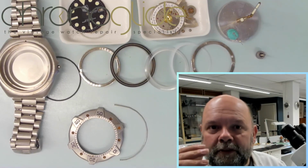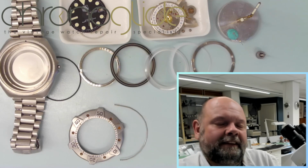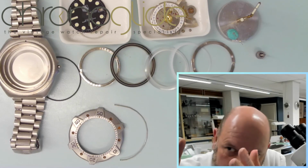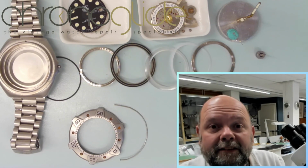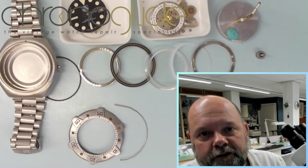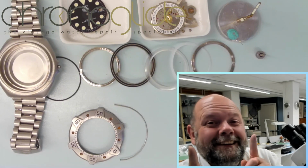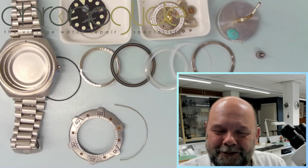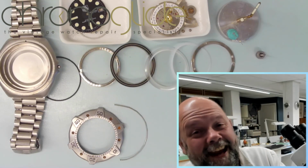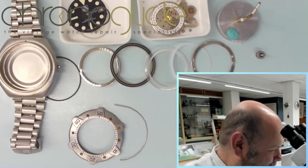So we first start with a 0.8 vacuum test, and then at least 5 bar we compress it, and both the tests combined will tell you an excellent result for the water resistance, or better, air tightness of the watch, because we use a dry test, and if it's airtight, it is water resistant, watertight.